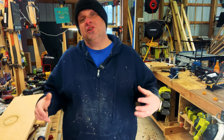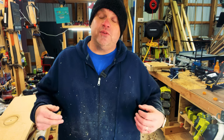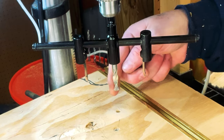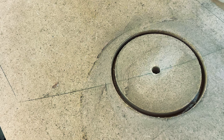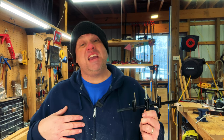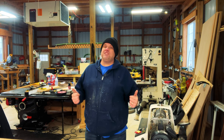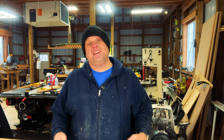Unfortunately this bit was just a little too big for my drill press — the motor was consistently bogging down and I don't want to burn it up. However, if you have a more powerful drill press this bit might be the one for you. Also keep in mind you want to slow the motor down quite considerably, since the cutting edge is spinning much faster out at the perimeter than at the center. Even though I wasn't able to get through the entire piece of MDF, it did leave a very clean cut hole. The swing arms are also a safety concern when the drill press is running. So I'm disappointed I won't be able to use this in my shop, but if you have a more powerful drill press and need to make larger diameter holes, it might be the thing for you.